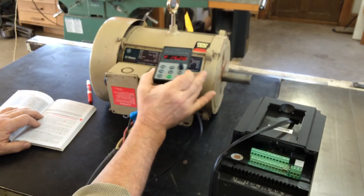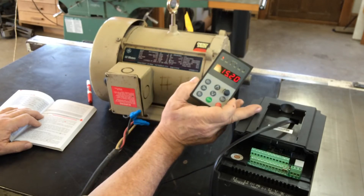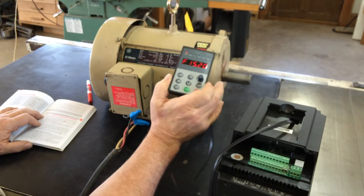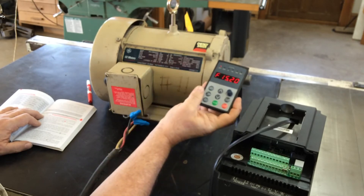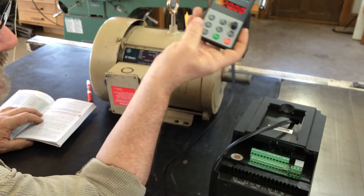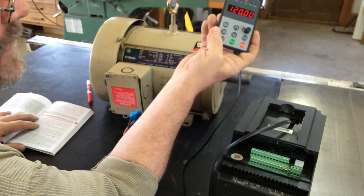In this case, 1765. The voltage is adjustable from 200 to 260. Also, the drives are adjustable in kilowatts from zero to their output. This is a five horsepower drive — it doesn't have a range like some drives do, so for overload protection they're not very good. I set the amps and I set the hertz. The drive comes set to 50 hertz from the factory. Of course, I'm in Canada — this is 60 hertz. The hertz can be set from anywhere from zero to 600.